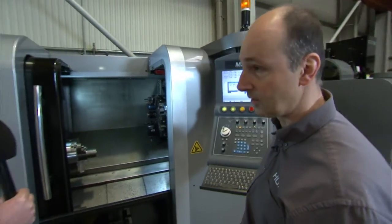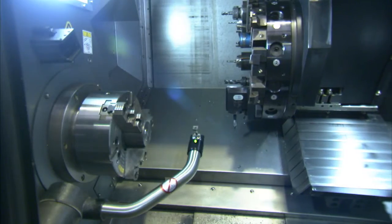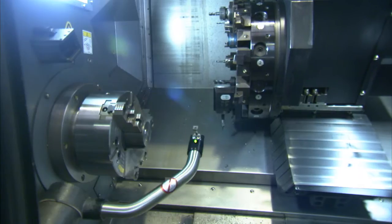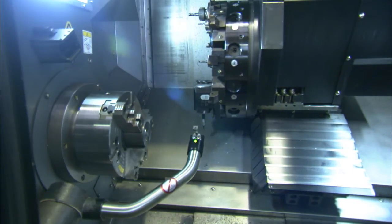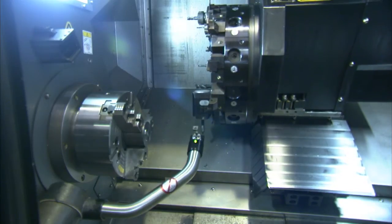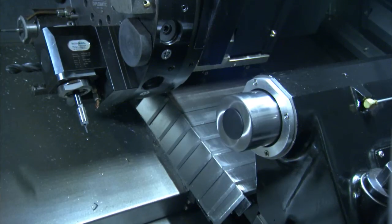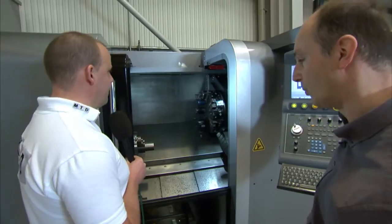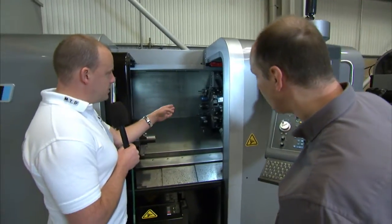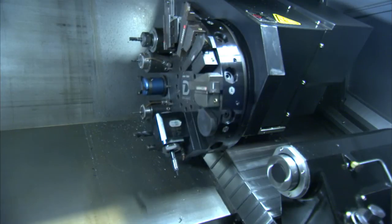The TMM8 will take 65mm through the spindle. All the lathes come with a tool setter, part catcher, and a programmable tailstock from the quill. The tailstock itself will actually be moved up the machine via the Z axis — there's a hitch that connects the tailstock to the turret and then you pull the tailstock into position. The turret itself looks to me like a VDI turret. Yes, this is a VDI-40 turret — it's a Duplomatic turret.